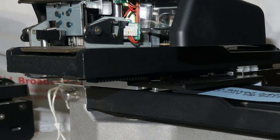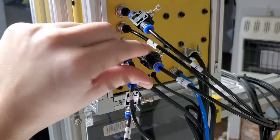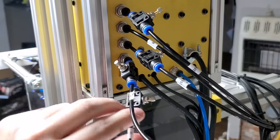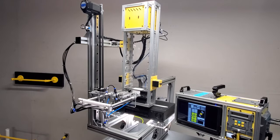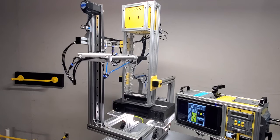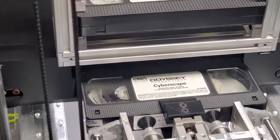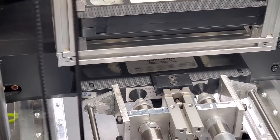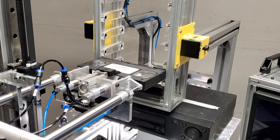The Sony FlexiCart has a bigger range of motion than the pneumatics do. Back to my tape bot design — I use pneumatics and I don't necessarily regret the decision, but they have a limited range of motion: it's either on or off. While you can control that with sensor feedback, it's just not the best solution. Going forward, I'll probably replace the extender drive with a servo or stepper motor for better control. I had quite a few crashes with the extender, and even at low PSI it makes the frame flex and bend. That could be avoided with a stepper motor and collision detection.